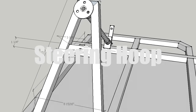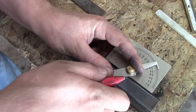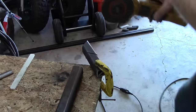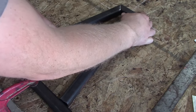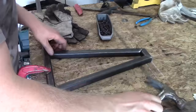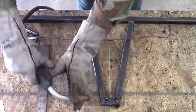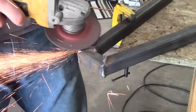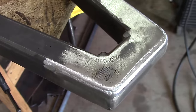The next thing is the steering hoop, which is what the column will be attached to. Take your protractor and cut exactly a 51-degree angle for the cuts for the top of the hoop and the two side supports. You can cut from both sides if needed. Use a jig or setup to prevent warping when you weld. Tack weld first to hold everything in place, then do your final welds. Grind down the welds and polish them up for a clean finish.